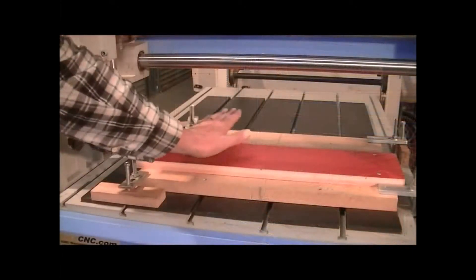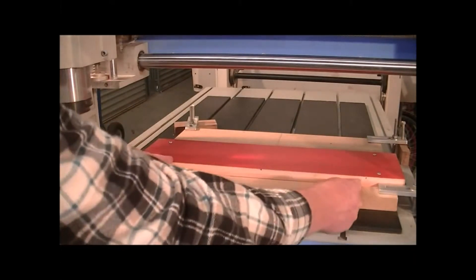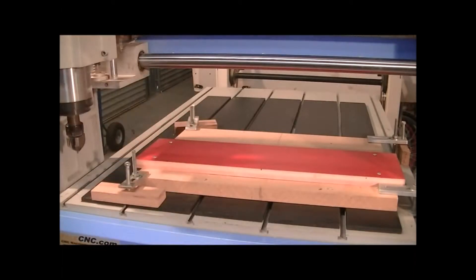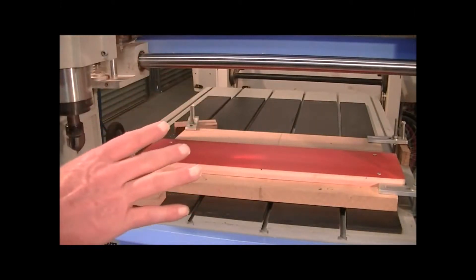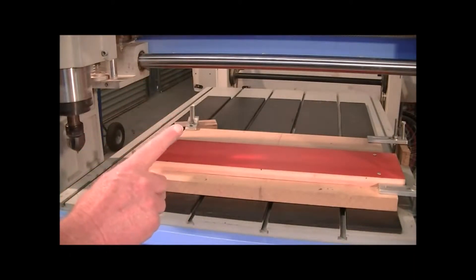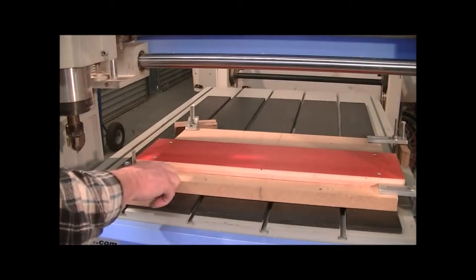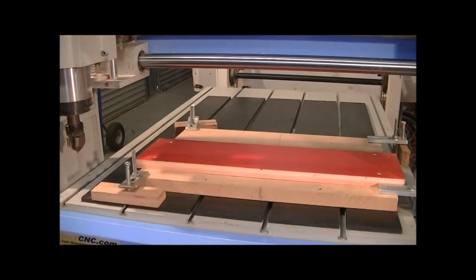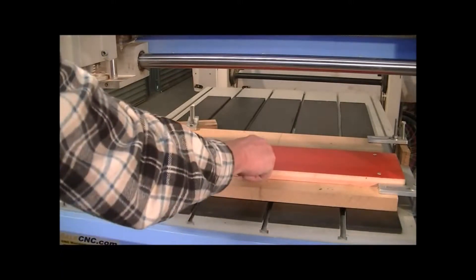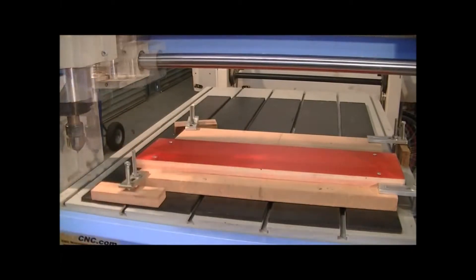This is our piece of work. The work, or the end product, is going to be 400 millimetres long and 140 millimetres wide. In this case we start the program, or the work offset, right at this left-hand front corner, which is the norm. I actually switch depending on what the job is — whether I start at the dead centre of the material or whether I start on this front left corner.